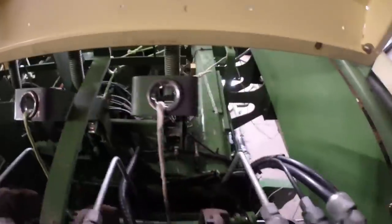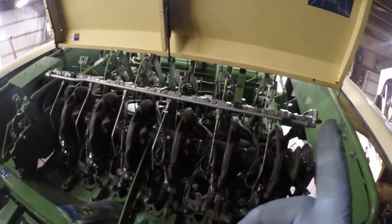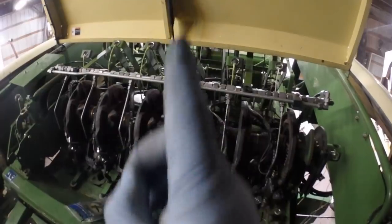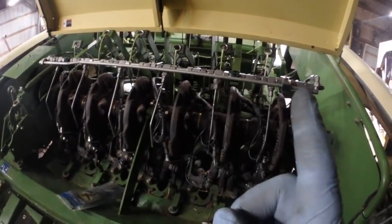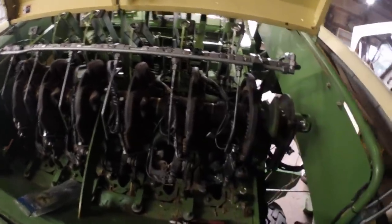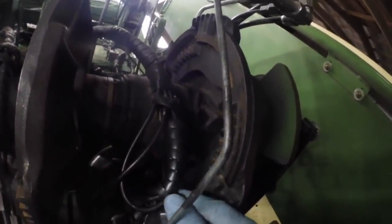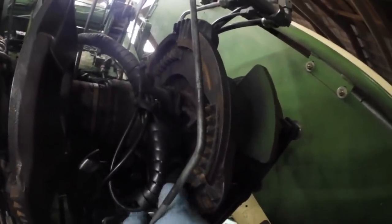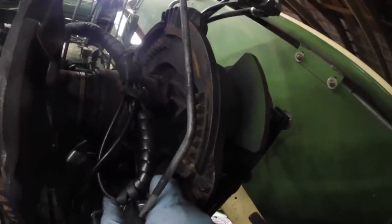The New Holland had a little bit different system than what this one does. The New Holland system had this little toggle valve. It would build pressure, and then it would feed one set of lines in that bank, and then it would release the pressure, and then boom, the toggle would go over, and then it would feed the other bank. Now, the difference between this one on the Krone and the New Hollands that I owned years ago is that these guys are actually on a priority.